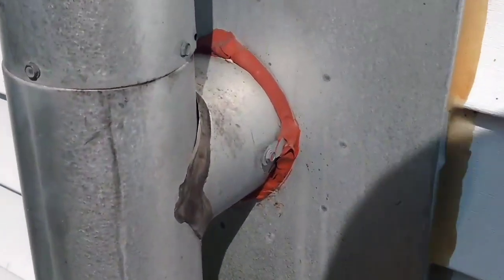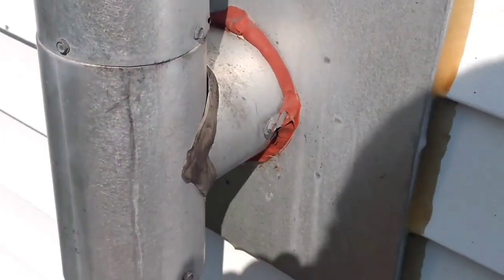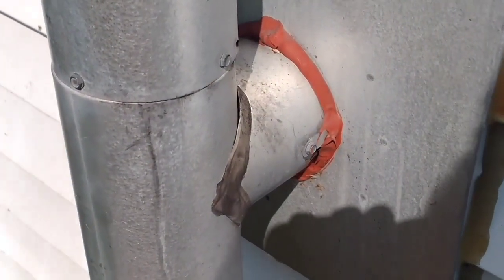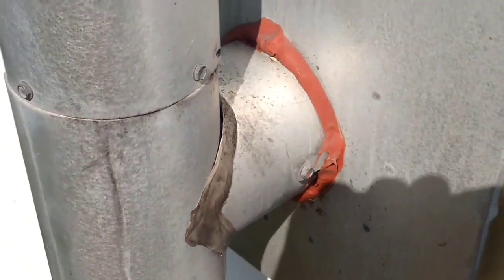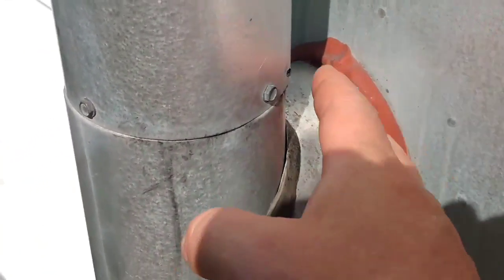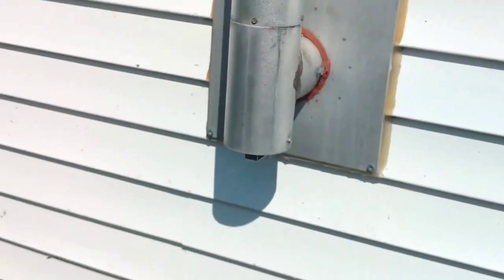chimney. And what I always like to do too is you have your pipe that goes through your wall that connects to your wood stove. You always want to make sure that that's not building up with creosote and whatnot too. So a trick that I usually do is take one of the toilet unclogger tools and shove it through there, spin it, breaks up any debris inside there, and you can usually hook up a vacuum and bend it to get in there to clean it out.